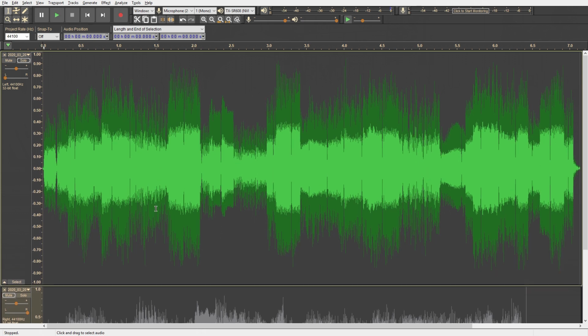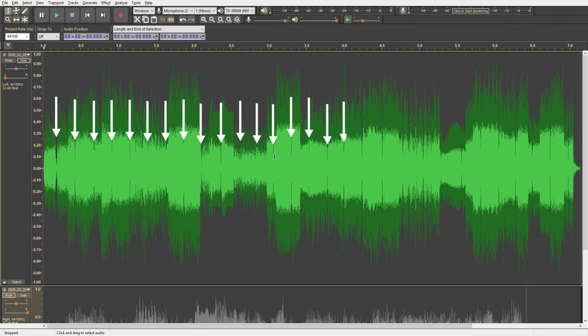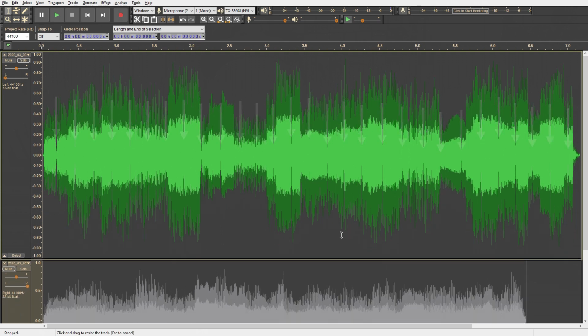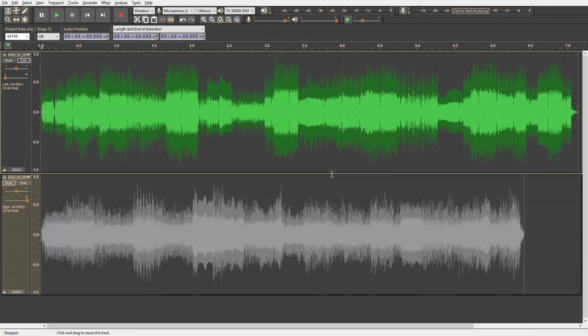What I want you to really notice here, look at the Partycade audio. The sound that you're hearing, that choppy sound, are these little cuts. You can see where the audio dips to almost nothing at regular intervals. That's the hardware not able to keep up with the ROM. Every one of these little cuts in the audio are where it dips down to almost nothing because it can't generate sound at that point.